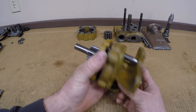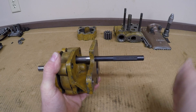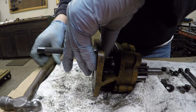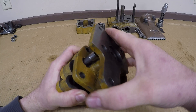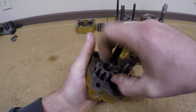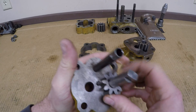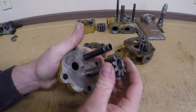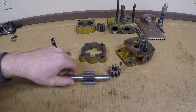The next step is to remove the base from what's left of the pump — it's normally a press fit onto this little standpipe right here. The manual will have you grip this intermediate piece they call the separator, put it in a vise, and then carefully remove the base from the pump assembly. I don't like to clamp it in a vise because I don't want to displace any metal or create any burrs. So I just take a small driver that fits well into the end of that standpipe and knock it out by hand — put the driver in that tube, gently tap. With the base free from the pipe, it just gets pulled off, and here are the auxiliary pump gears. The idler can just be pulled out, the body just pulls off, and the auxiliary drive gear is keyed to the shaft. That can be removed without a puller. The pump drive shaft can then be removed from the separator and you have a fully disassembled pump.